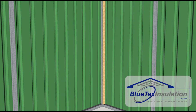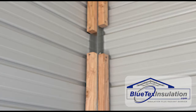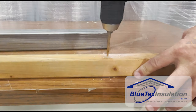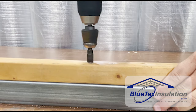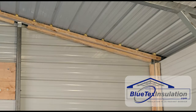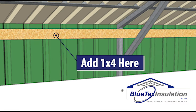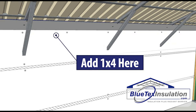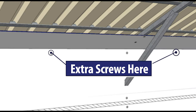So what we're going to do is add some wood strips to these corners. You can use a two-by-two or a two-by-four and rip it. You'll use self-drilling screws — I'd pre-drill the wood — and connect this wood onto these corners to make what's called a hard corner. If you've ever done drywall, that's basically what you're doing: creating a hard corner for the Blutex to attach into. For the transition between the wall and the roof, put either a one-by-four or a one-by-two up in the corner, installed kind of like crown molding, so you have a hard corner to make that transition from the wall to the roof.